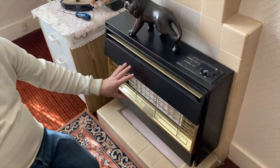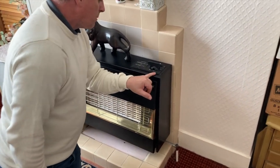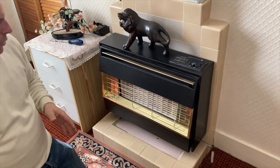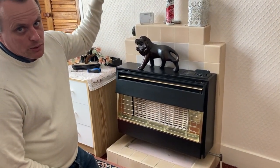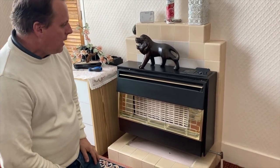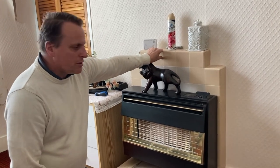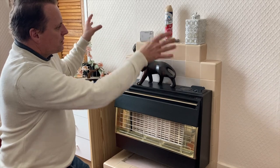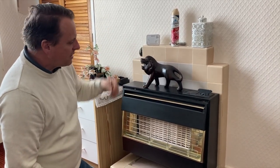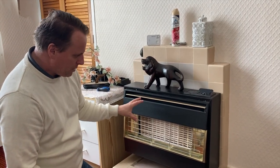Finally on services, we look at the heating. Each room has one of these old gas fires — not recently installed. Controls are room by room: basic on/off with no central thermostat or central programmer, and these fires are fairly inefficient. It would explain why the flues are open outside — we can't cap anything with a gas fire using those flues. As part of the overall renovation, it would be worth getting rid of these and having a more appropriate fireplace — a decorative cast iron surround with a log grate, which could remain ventilated. A good central heating system would be much better for a property of this age and type.